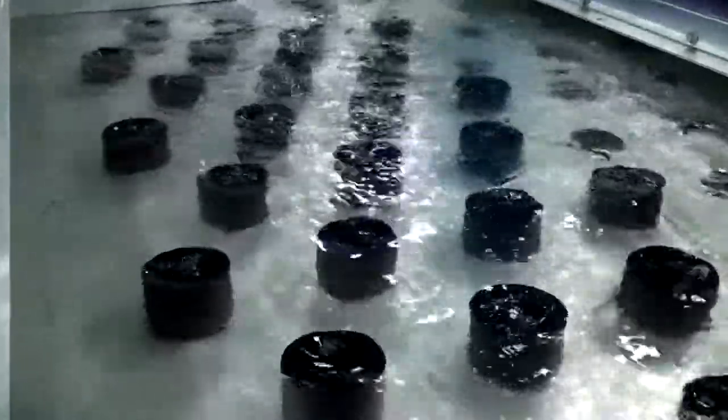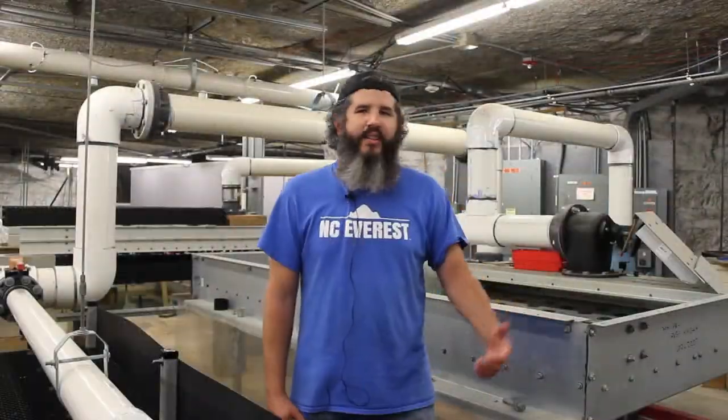To a point where this would be 100% design flow with uniform distribution over the full heat transfer surface. There's still room in this basin for additional flow, and we'd be able to take this basin up to about 5 inches of head, which would be about 120% of the design flow. And this is how nozzle cups are used in NC Towers. This is Rob Neklis — thanks for watching.